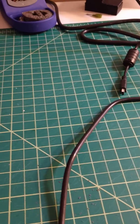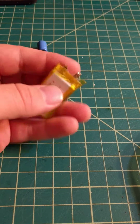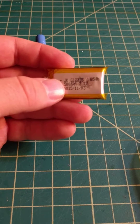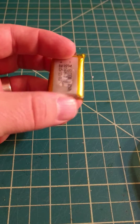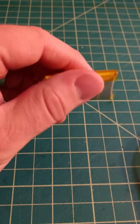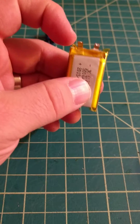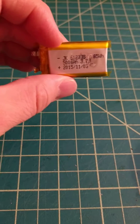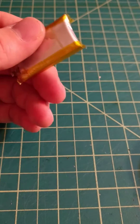So I took it apart and this is the battery inside. It's just this little part — JK6123 38-size battery. It's about 32 millimeters long, about 23 millimeters wide, and about 8 millimeters thick. When I measured it on the voltmeter it was only seven tenths of a volt.